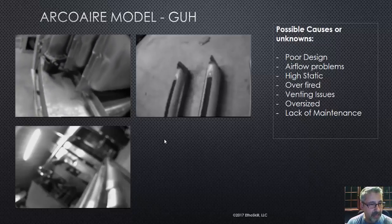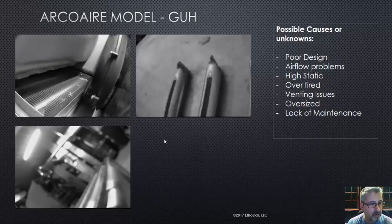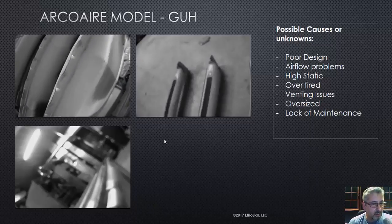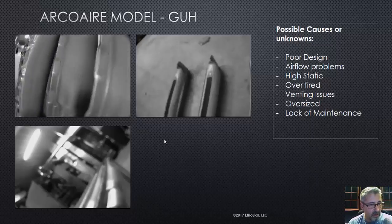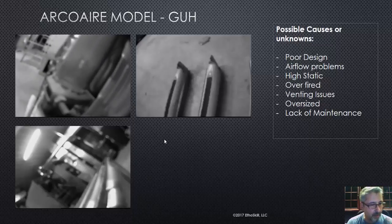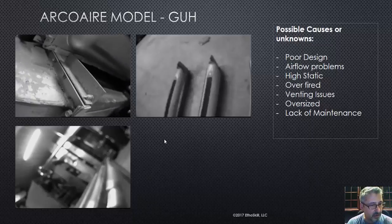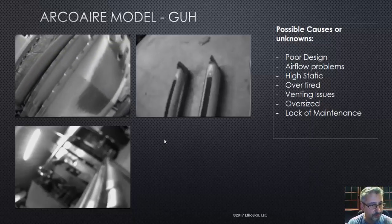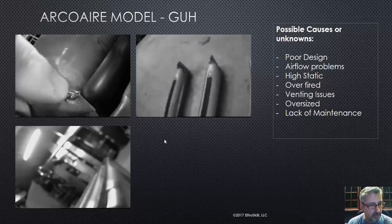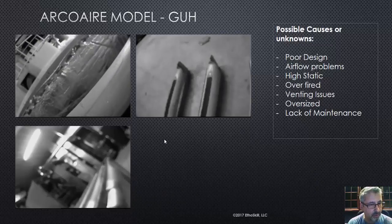There's the back header and the tube — that's stainless steel. That's a stainless secondary fin-style with fins, which is actually a pretty good secondary — everybody's pretty much gone to that. I'm showing some corrosion on that pipe that I discovered. I investigated that further and I'll show you what I found in the next video. Technicians, always check that — if you see corrosion, that's a problem. There shouldn't be any corrosion there.